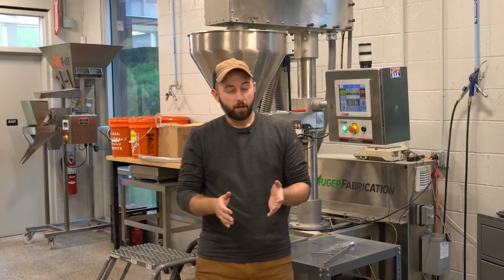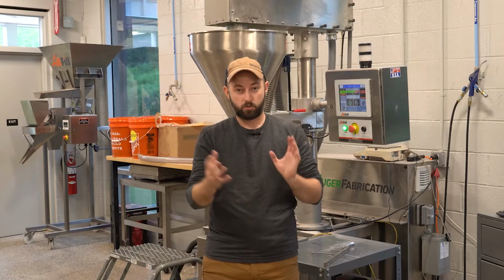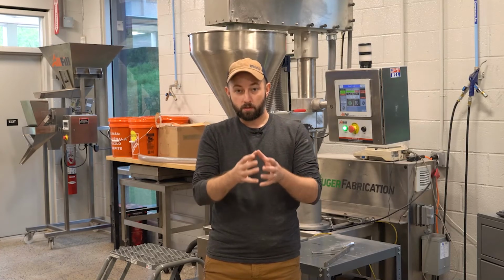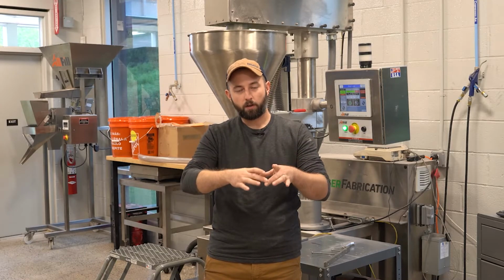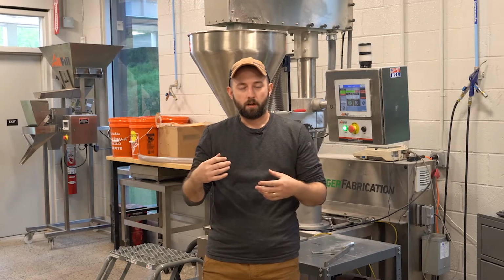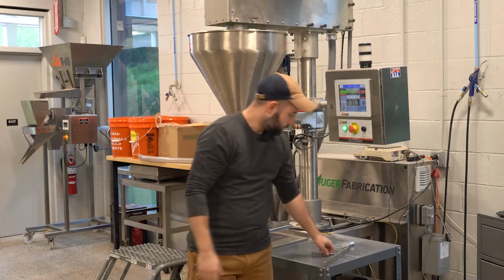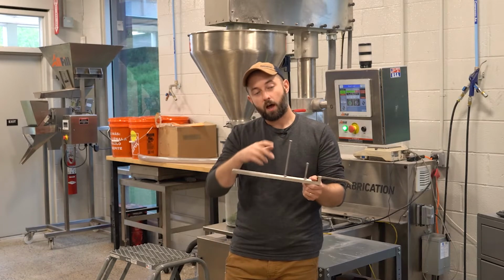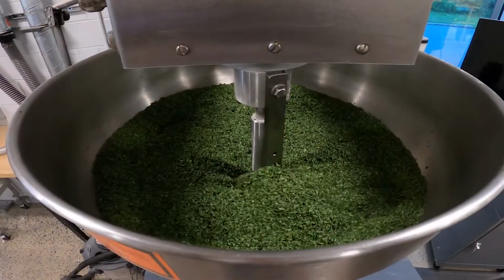So what you saw in that clip shows the effectiveness of the flake blade. The mass was no longer turning on the outside of the hopper. It was more targeted towards the center of the auger, center of the machine. But you did start to create a little bit of a valley, a void around the auger. Now, in this case, it wasn't that bad. You'd probably be fine with a standard flake blade agitation. But just for the sake of demonstrating it, we're gonna add the customized flake blade to show how this agitation on the outside edge of the hopper helps alleviate that cavity that starts to show up in the center of the machine.